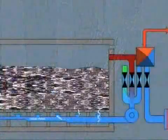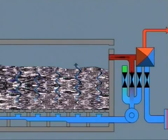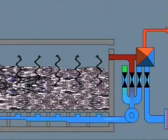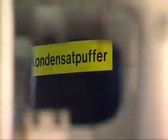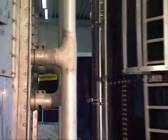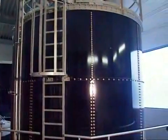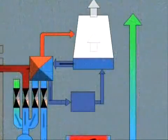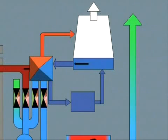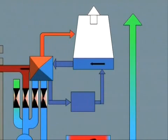The process air is charged with moisture and waste gases, which flow out of the boxes. Process air and waste water are then treated. The moisture is condensed over a heat exchanger and is subsequently filtered and cleaned — only then is it put back into circulation. This is another reason why the Stabilate process has a head start.